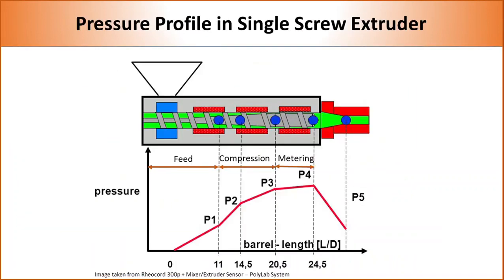The pressure inside a single screw extruder gradually increases from the feed zone to the metering zone, reflecting the decrease in flight depth and the amount of shear applied in each zone. As polymers are always under pressure inside the barrel, we cannot put a vent in a single screw extruder, because polymer melt would shoot out. Recent developments in screw design have allowed venting in single screw extruders, but it is still not widely adopted.